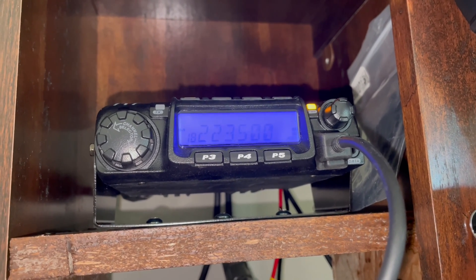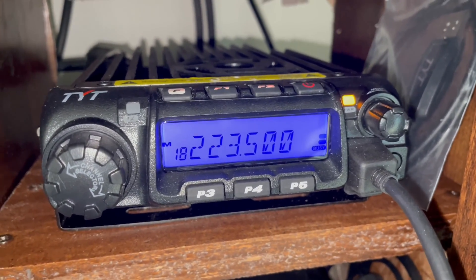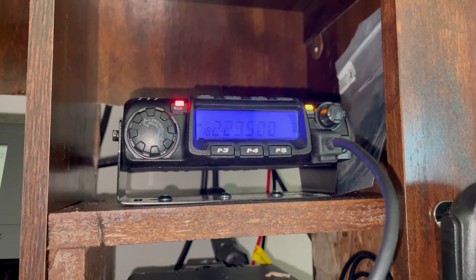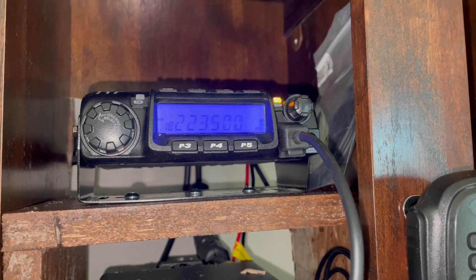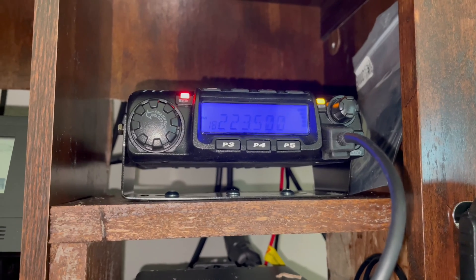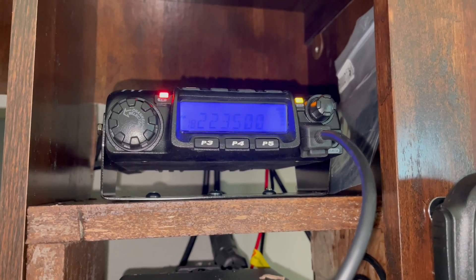When I had the mobile antenna up, I could never hear Greg at all — he wouldn't even break my squelch. He's at least breaking the squelch now, but there's a lot of static behind his signal. Okay, K0FYR on 223.5 — if you were talking to me, I caught about 70% static and about 30% audio. I've got my new Diamond F142A up and I'm at least hearing your voice now, but there's a lot of static behind it.